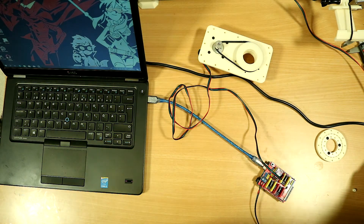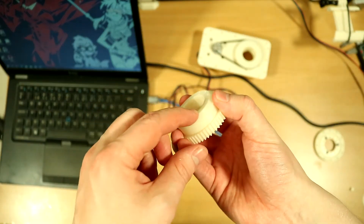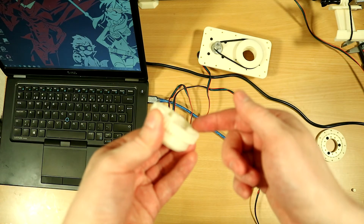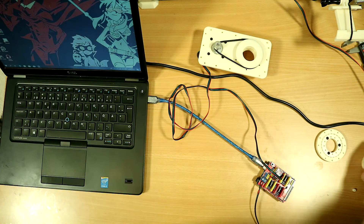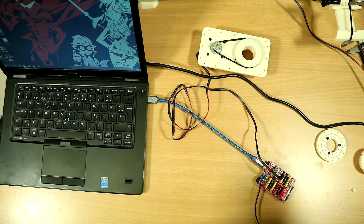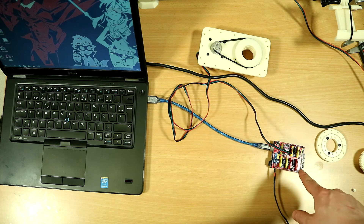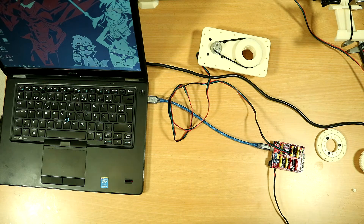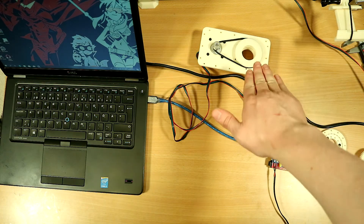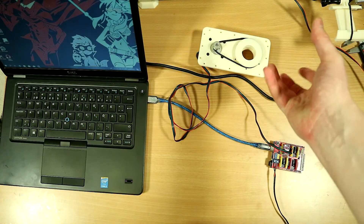This part here is essentially made like this — we've made it a taller top part for the bearings with a timing belt setup, and that just sits on top there. We then have a belt that goes around and is attached to the motor and to the gear. Driving this entire thing is a CNC shield, which is just an Arduino with a single stepper motor driver. I can have four drivers here, which means I can do left, right, up, down on the slider, and possibly control the lens focusing in the future.